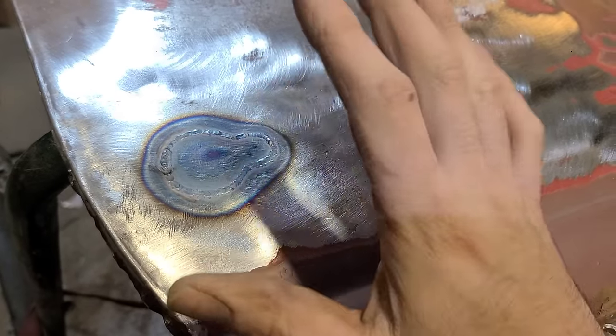The challenge with door handles, of course, is that there's a lot of additional damage around them, usually just from people slamming the door for 70 some odd years. It's always going to be kicked in a bit, or even just the way the factory stamps the holes can also cause some issues in the surrounding metal.